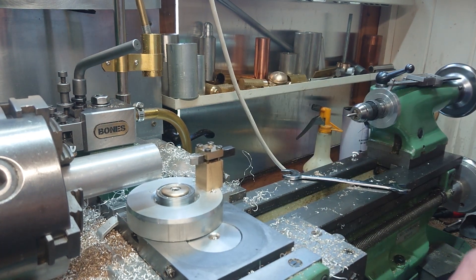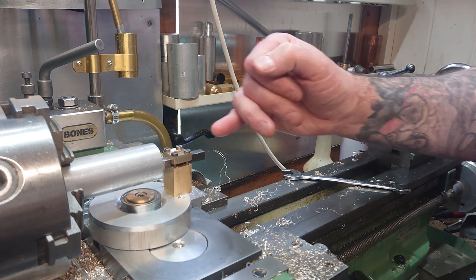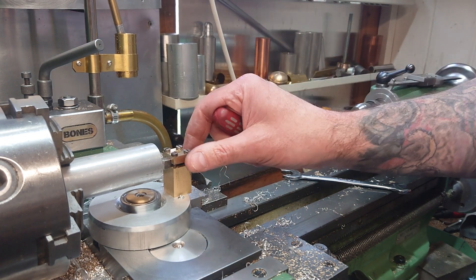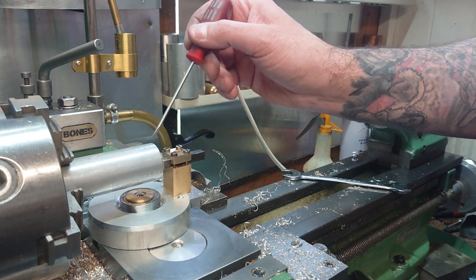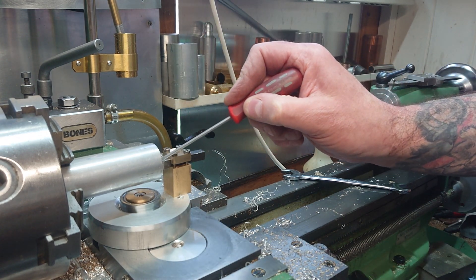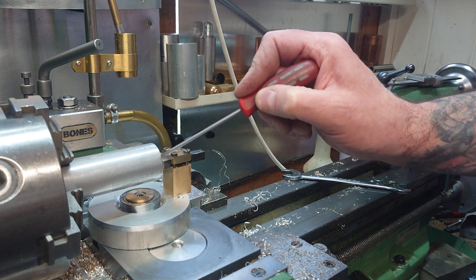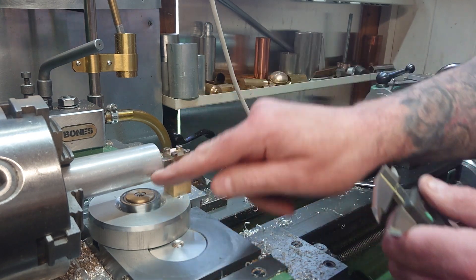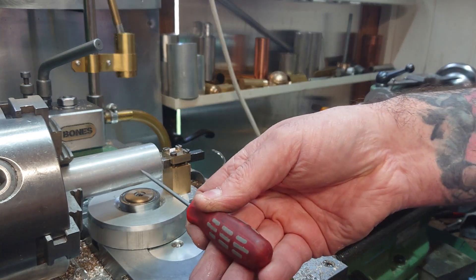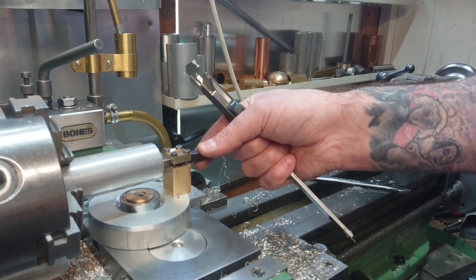So what I've sussed out so far — this is the third or fourth time I've done this — the point of your cutting tool needs to be dead centre, that's a given, everyone knows that. But if you are making a radius of a semicircle, I figured out that the distance from the centre of the bar to the tool point needs to be half the diameter of the bar. So as it swings around, it should produce exactly a semicircle.